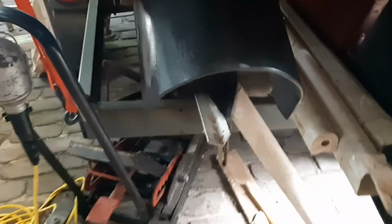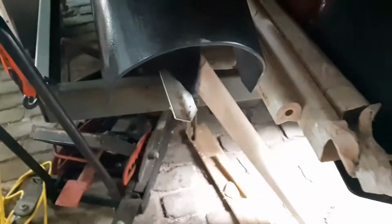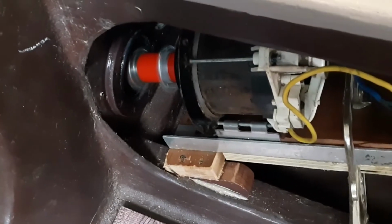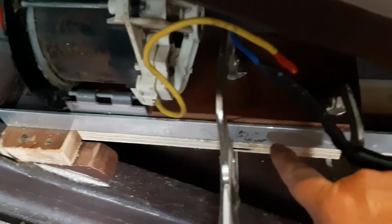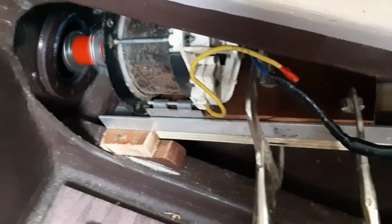Seems the lower speed gives it more of a chance for the end to vibrate. So we'll try a third hose clamp. So, running much better with a third hose clamp to throw a little more weight where it's needed. Also, I'm clamping in and gluing in a nice thick piece of ply to basically attach those two, and the two runners more solidly, because I find the back corners vibrating and I can't clamp over to that well enough. So this bigger clamp, once that's glued, time for some lunch. Once that's glued, that should run better.